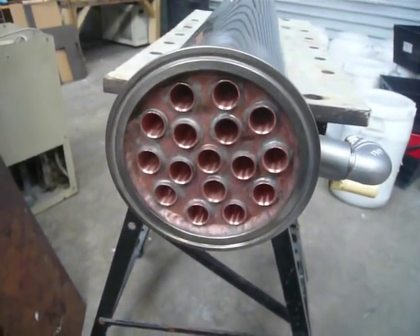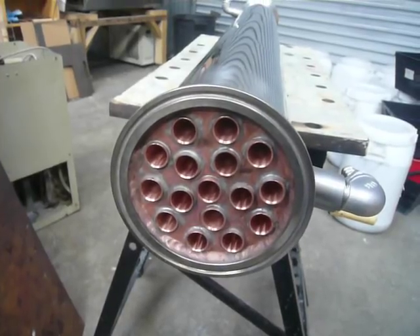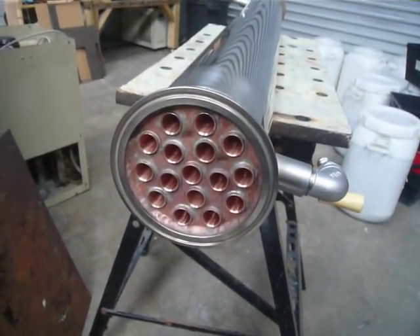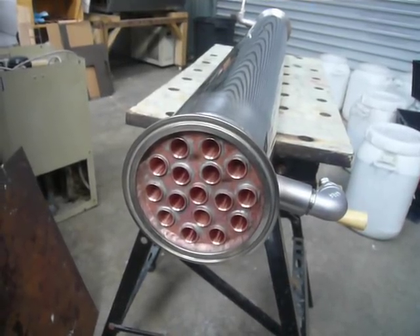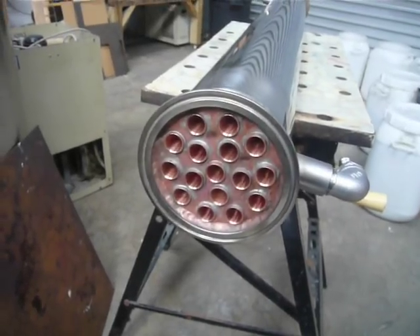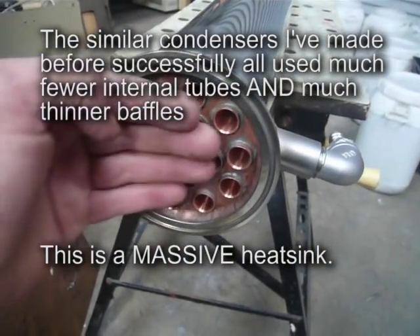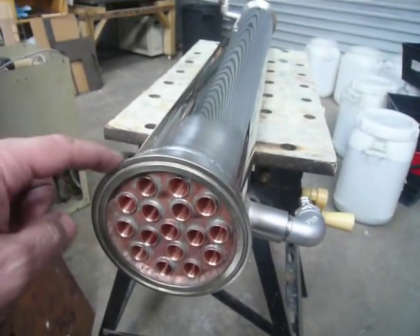Here is the result of what came out of that mess — the last clip was a failed attempt at silver-soldering the baffle into this tube. I tried re-soldering it, ripped the ferrule off and remade it, and still couldn't get that join to take. I think there are a number of factors: the heat sink from a 3mm thick baffle, 16 tubes, the size of the jacket, and the fact that the baffle and everything is so close to the edge of the ferrule.